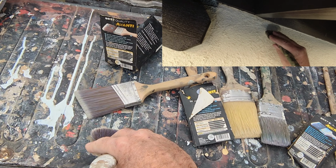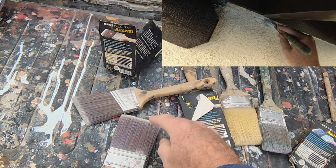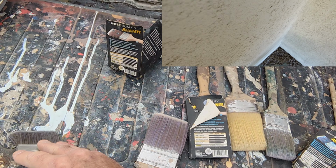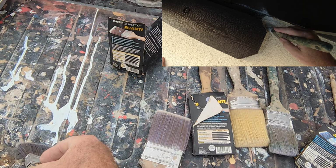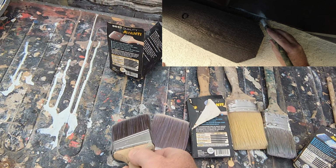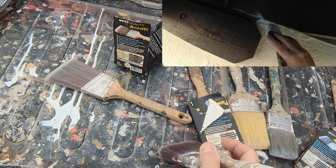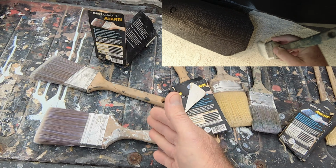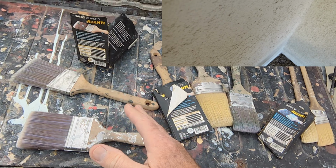When you're pulling it through, it will actually follow into the cracks better than this one, which will kind of skate over them because of the angle of it. You'll be pulling it, and these little bristles will go over the stucco, and you'll have to go 2 directions, versus you could do it almost in one, doing it this way or just this way. It takes a little bit less time, so you get a little more mileage, you're a little faster. But what guys have done is stay with a habit.